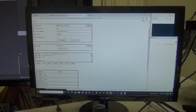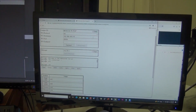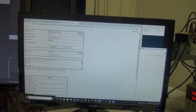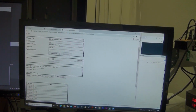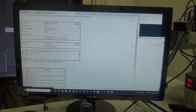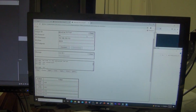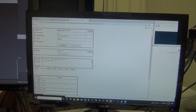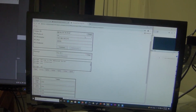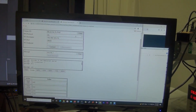So basically, we have the capability to serve the page in the JavaScript through a web page, or we can run it locally. We don't actually use any app at all. This is just basically Chrome opening up an HTML5 and Java with associated JavaScript. So this can be served from anywhere in the internet, and then you can control each individual robot through this simple client interface. And this client basically shows that with the WebSocket API and the Frontline server, we can connect to each individual robot and control it. So that's the purpose over here, what we're going to show.